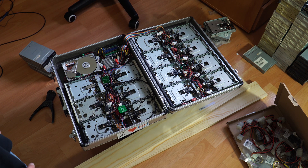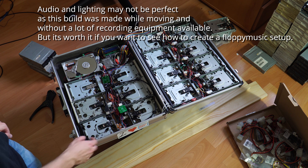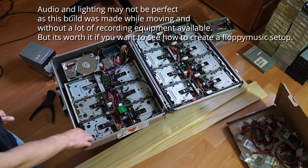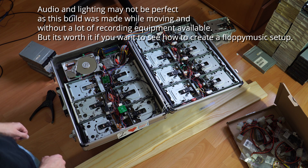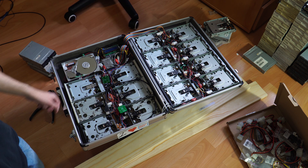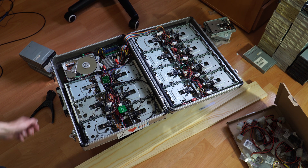In this video I want to build a new floppy music setup. This is my old setup. Unfortunately, I didn't record any footage of the build back then. It was made in about a weekend many years ago and the drives are still only held in with some adhesive-backed velcro tape. The signal wires are just jumper cables and the power distribution is a long and way too thin cable, causing problems all the time when being transported and the voltage drop on the end is quite significant, causing the drives to sometimes reset.